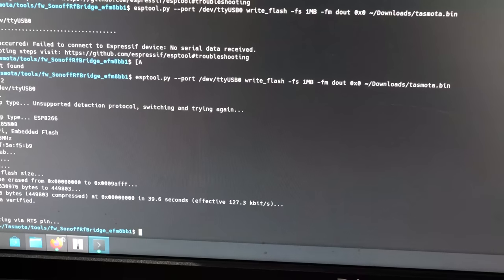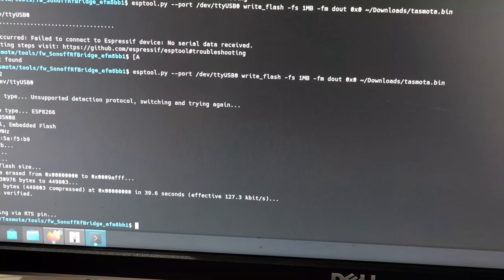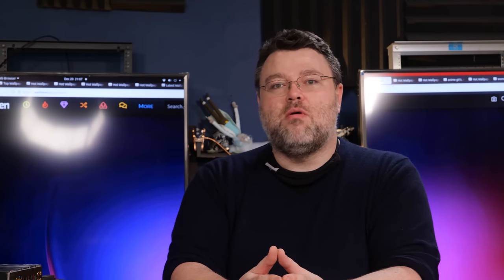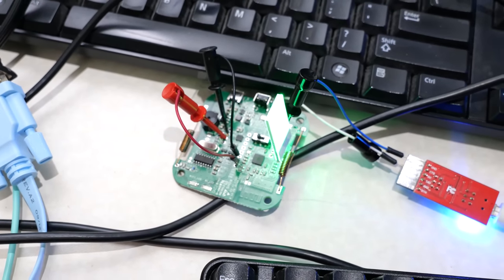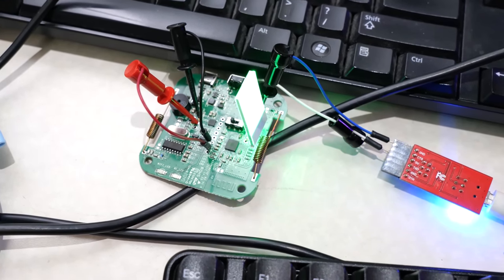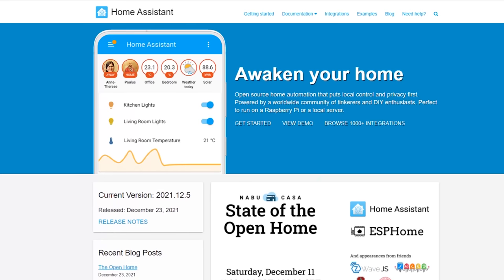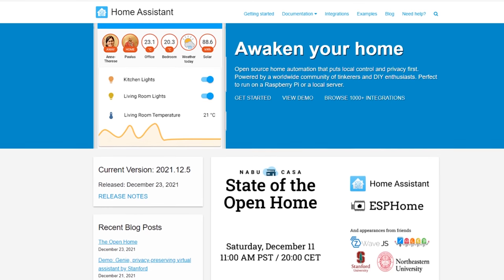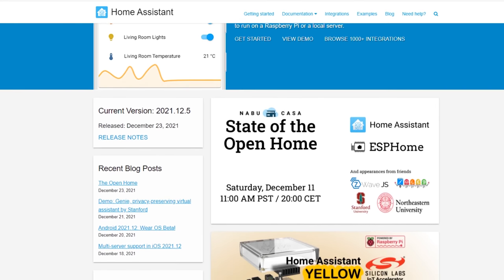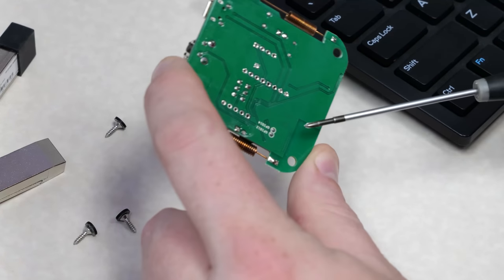With the updated radio firmware, this thing can hear pretty much anything at 433 megahertz. You can log into the web GUI and it gives you a console to type commands in. If you have an alarm motion sensor, you can wave your arms and come back to see if the event was captured, then subscribe to events from that sensor and forward them on to Home Assistant. This supports remembering about eight devices per puck — that may vary a little with hardware and other parameters — eight wireless devices it can listen for and then forward the events to Home Assistant. I'm fine with that.